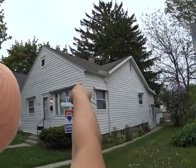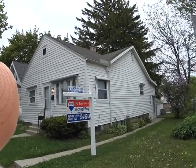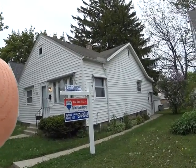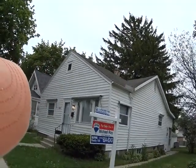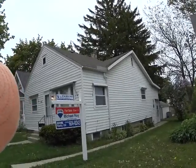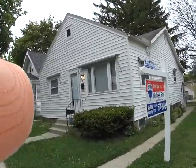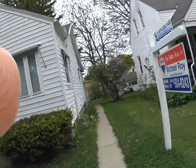Just to give you a heads up, that valley was not done right. They did connect — this is another way you can do valleys without metal. But the unfortunate thing is it's not straight, and I don't know if you can see that line. But it works. As long as there's no water coming in, it's fine. Just so you know, that valley is not a straight valley.